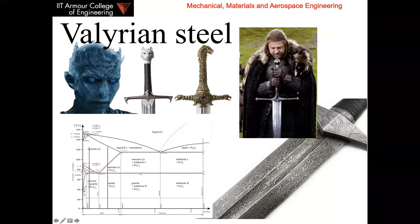It has this marbled appearance because it is actually a composite material. It is made out of alternating layers of very low carbon soft steel and high carbon, very hard, durable steel that is able to retain a very, very fine edge. So this Damascus steel is created by taking two different types of steel and then forging them together so that you create basically a steel with lots of very distinct layers of the different types of steel within them.